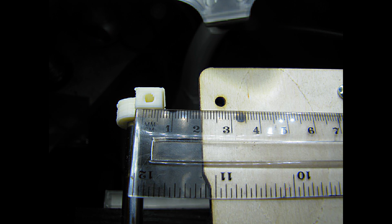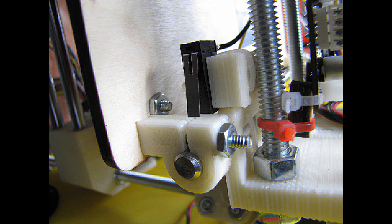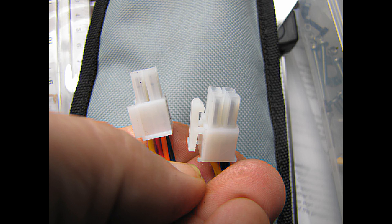Mine was a very early kit and things were not perfect. The printrbot design changed slightly over time, so the tutorials didn't quite match up and some were slightly out of sequence. The new bed is narrower. Some parts like the Y pulley cracked, the Y limit switch missed the mark, and the Z axis micro needed improvisation. I had to supply my own power supply, and if the wrong plug will go in the hole, that's usually where it goes.